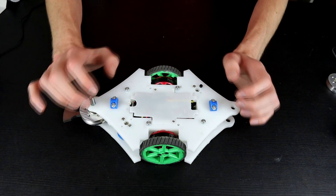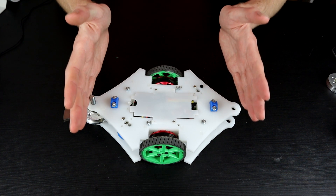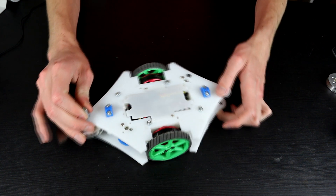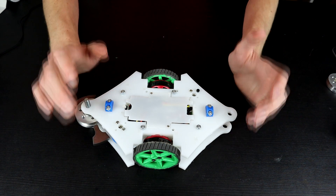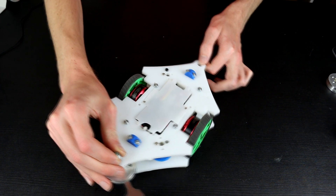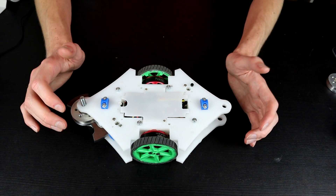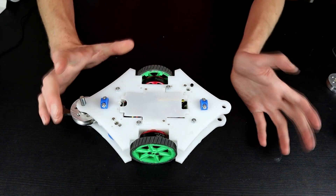The problem I've realized is that I'm controlling these motors with servo signals — a two-millisecond pulse inside a 20-millisecond frame — where they pulse and then wait until the end of 20 milliseconds and go again. But the melty can spin up to 216 degrees in that time, meaning from here all the way around to here. So using servo signals, I'm only sending one command to each wheel per rotation. While I was trying to speed up here and slow back down here, I was getting none of that. So now I need to get the melty working with a different system — probably a sped-up servo system.